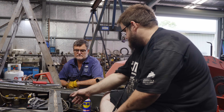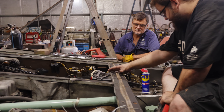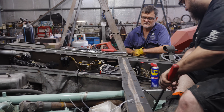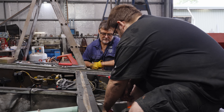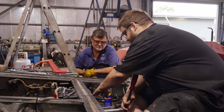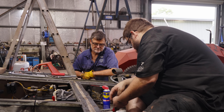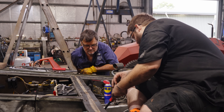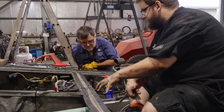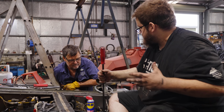Realistically, I've undone the firewall there. All that electrical stays there. I've got to suck the brake fluid out of the reservoirs, otherwise it's going to come pouring out. All those bits and stuff actually stay on the firewall. That rod stays up here. So the idea is to try and keep as much as possible together. When this comes out, leave it all together.